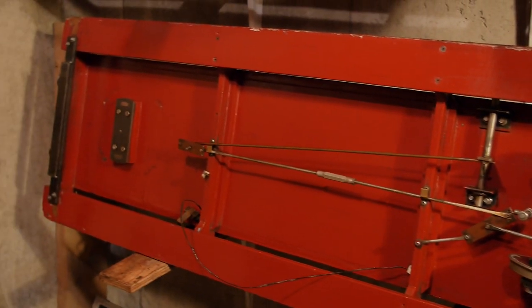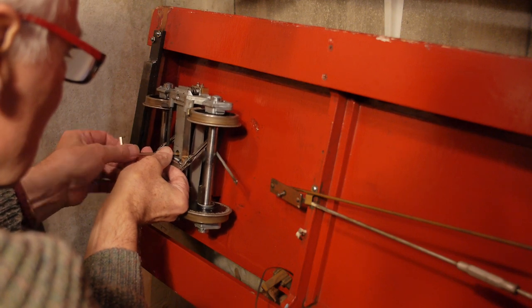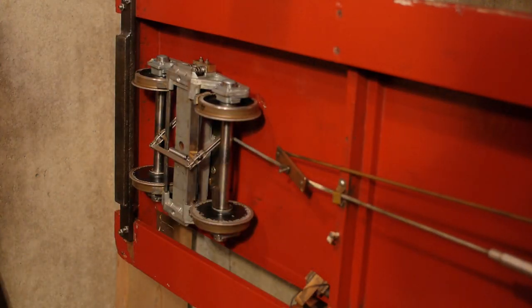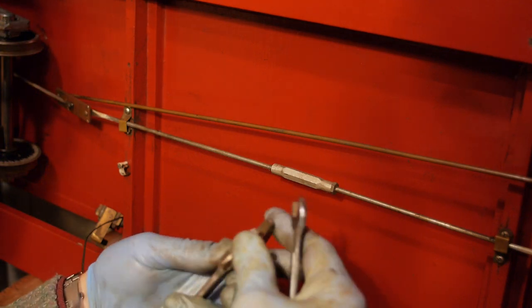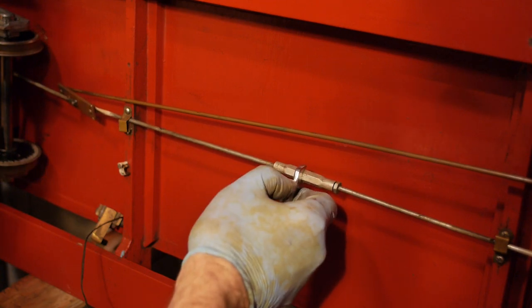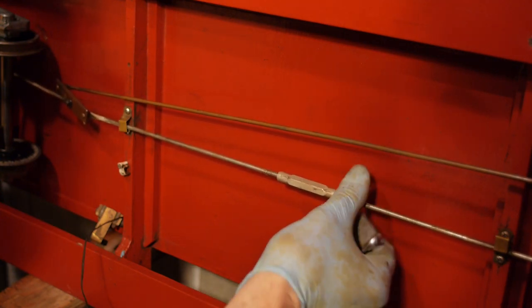The first bogie's on — let's get the second one on. This is always a great moment. Most of this rigging was bought from the hardware store, including this bottle here, which is a way of adjusting the brakes. They're a bit tight now, so I'm going to loosen this off — it's a really easy way of adjusting the tension on the brakes. Let the brakes out, then tighten it back up.